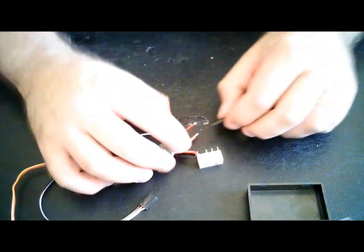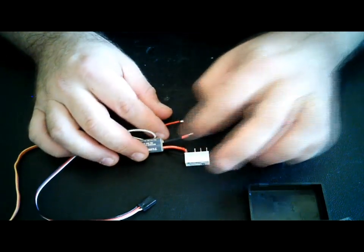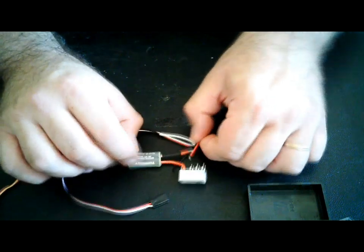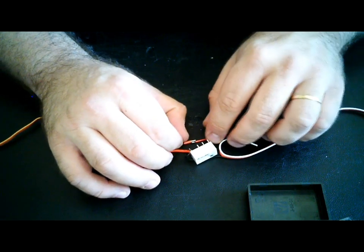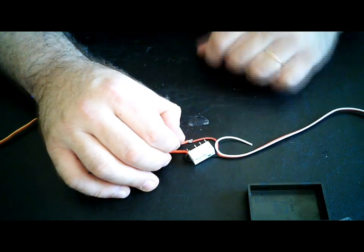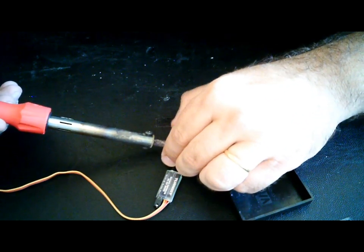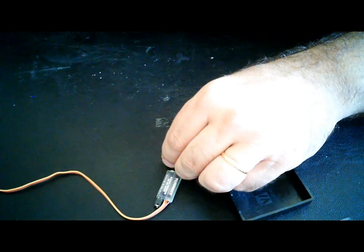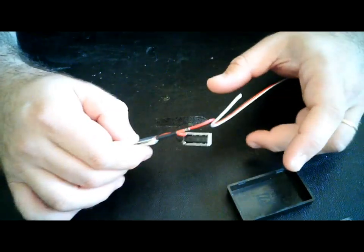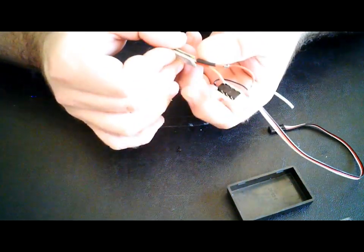Cut a little bit. Insert it over here. Be careful not to be very close to the heat, otherwise it will shrink and then you will not be able to solder it. Now just place the two wires together like this. Okay. Pick up your soldering iron. Just solder them together. There you go. Simple as that. Now, as I said, here's what happened. You see the shrinking tube? Shrunk over there.